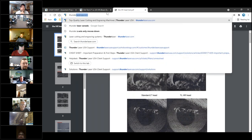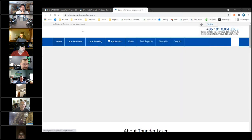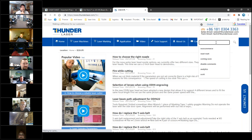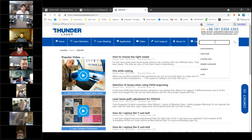Here's a document based on the Chinese report — this is the dot test. It's against the standard two-inch lens and the Beam Buddy. If we look at this PDF, it has all of them in there — the Thunder laser HR head versus the Beam Buddy head — and the Thunder HR head actually fared just a little bit better. Not a whole lot of difference, but there's the spot size comparison. So mine is the darker blue with the flat bottom — that's the Beam Buddy. The HR head is brighter blue. So you're saying I need to give you my credit card number if I want a Beam Buddy right now? What size laser do you have? I have the 35100. You might be able to get one at that — Brian hates it when I tell people this, but you throw that Beam Buddy on and you should be able to cut razor blades.